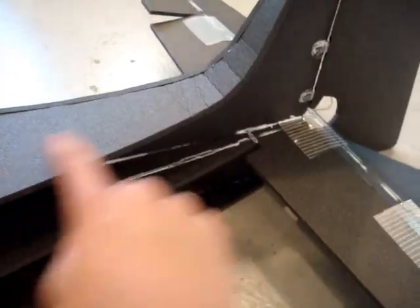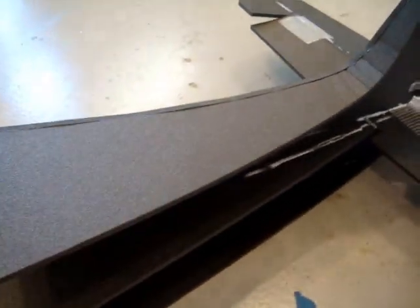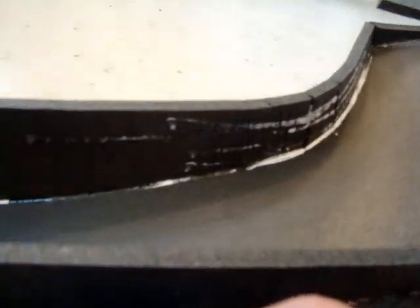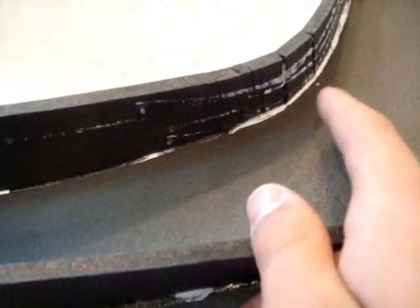And I've installed the upper deck piece here. To do that, first bevel the edge so that these will fit together, and then make lots of little cuts along the back here and slowly fold it, and then fill those with glue and put a lot of glue on that area to strengthen it back up. Once I've installed it, I think it's easier to install than the canopy, but note that I put the cuts on the inside and then bent it out. That looks good. So, once we're there, we're ready to install the motor.